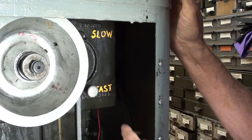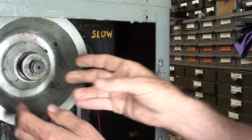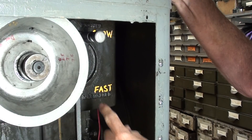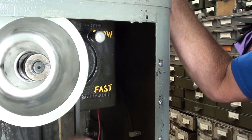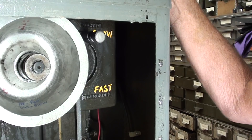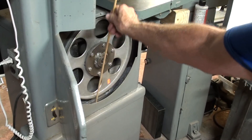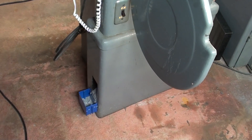I've marked it 'fast' but the word 'disengaged' is cast in, and at the top it says 'engaged' — I marked it 'slow.' This plunger is pulled out; now it's just freewheeling, and then I'll shift this into low. There are notches, there are holes for it. I have the machine unplugged — don't stick your hands in here when it's plugged in. Now it is on slow, and of course it's just the reverse for speeding it back up. It's quite a clever design, and it smells like 30-weight oil. There are some drips — it probably needs new seals. They went to the extra effort of putting in a collection system for the sawdust, so the sawdust flows down here, down into that hole, and ultimately comes out of this little exit hole down here. I've got a handy box to collect the swarf, so that's a nice feature.